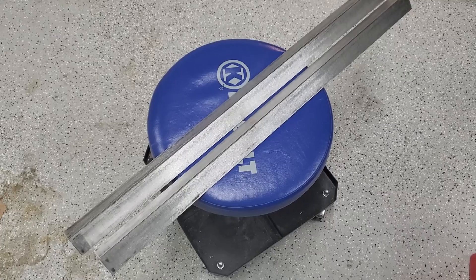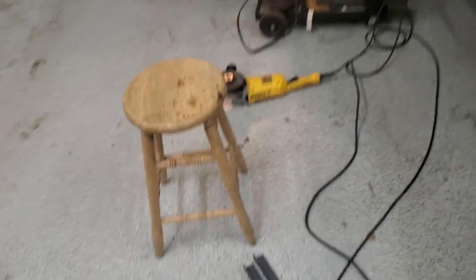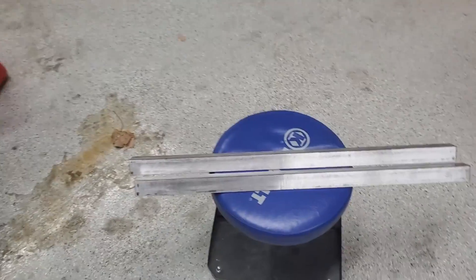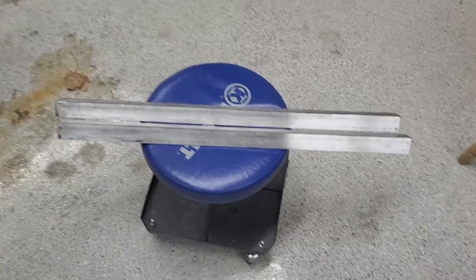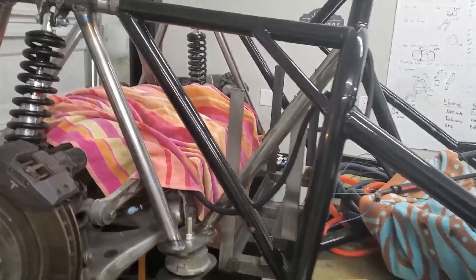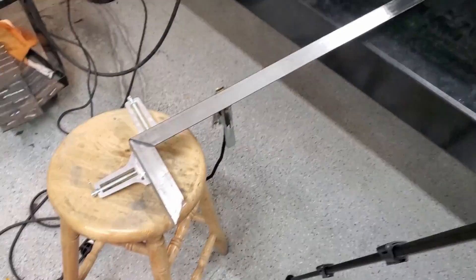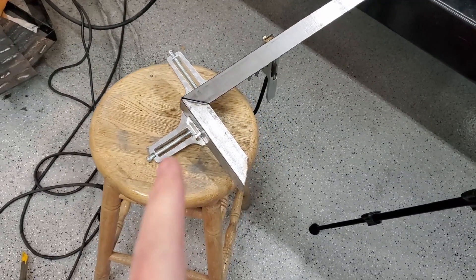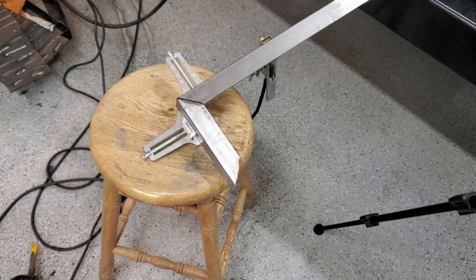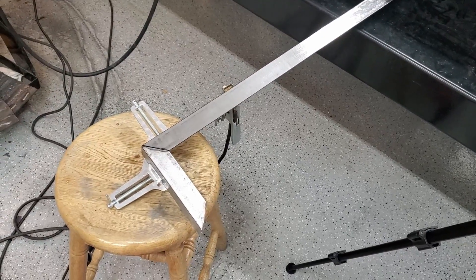All right, here they are all cleaned up. I tried the angle grinder as well as the belt sander — I tend to like the belt sander; I feel like I can maneuver the piece easier without clamping it down. Those are going to be the two side rails for the top. I just need to get the cross members, then weld them all together. I cut a 45-degree miter on both ends, and I've got this little right-angle clamp to do tack welds first to make sure it fits, then I'll weld it all up.